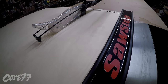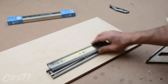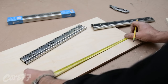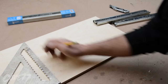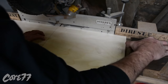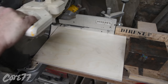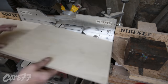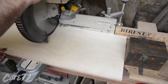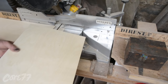I'm using half-inch Baltic Birch. I'm going to make a toolbox similar in configuration, but the bottom few trays are going to be drawers so I can pull them out. Everything can stay in place at all times and I can access what I need when I need it. Overall this is going to be approximately 16 inches front to back, about 36 inches left to right, and about 14 inches high, determined by the 14-inch drawer slides I used.